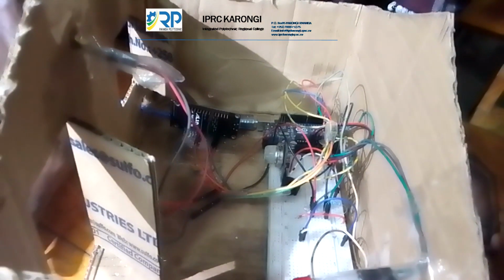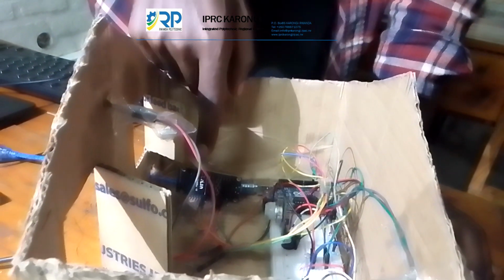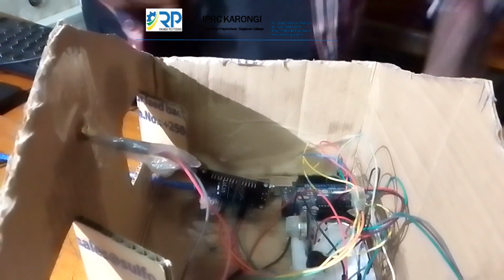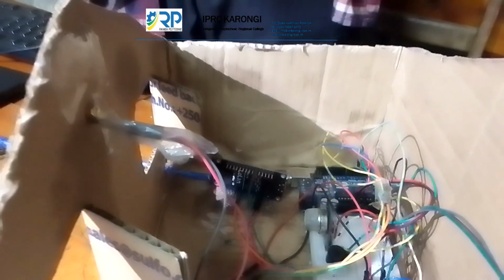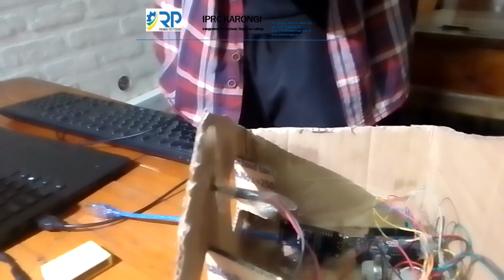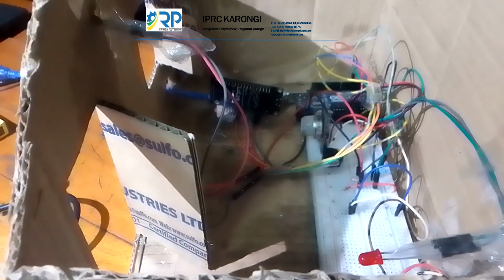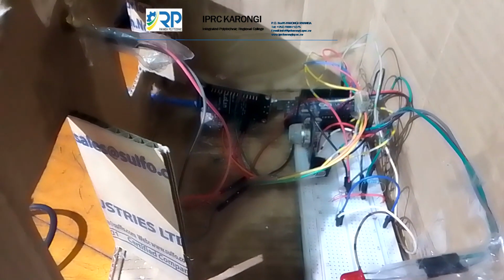And the next thing, we will have to upload or push our data to the cloud so that it is accessible to users on the cloud. Here we have a Wi-Fi module called ESP8266, which will help us deal with those data on the Firebase application. We will use the Firebase application to push our data to the cloud. Other devices we have are actuators. This is a red LED that will activate the light automatically, and this is the buzzer that will give sound output.